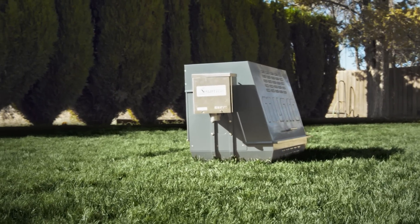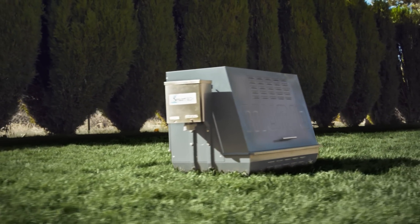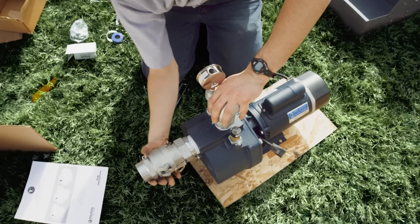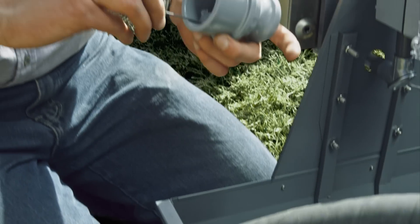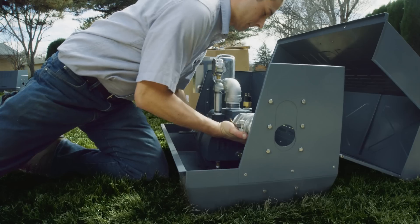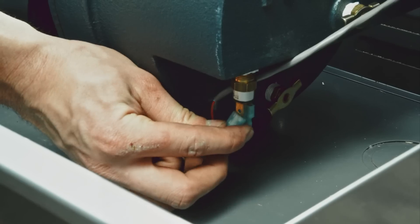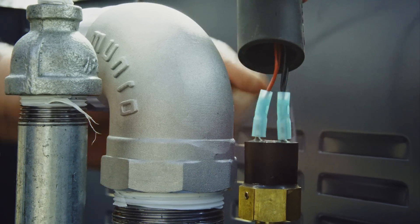The Monroe SmartBox protects your pump from overheating and run-dry using information from the sensors. Finally, connect the suction fitting assembly to the pump and glue the irrigation inlet cam onto the incoming suction line. Now, remove the pump from the packing board and place it in the enclosure. To complete the job, connect the temperature and pressure sensors and attach the rubber pressure sensor boot.